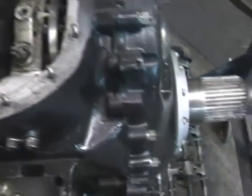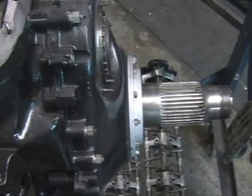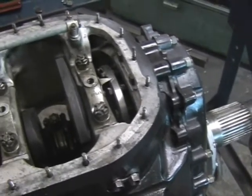This is of course a new crankcase because the original crankcase had the reduction gear section broken off it. So the crankcase and the front casing are replacements. The prop shaft is as well, but the small gear which you can't see now — the pinion in the bottom — is original, as are all the bearings which are on it.